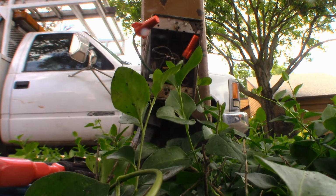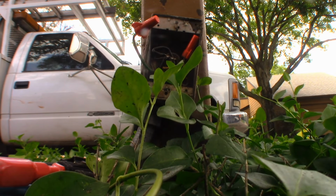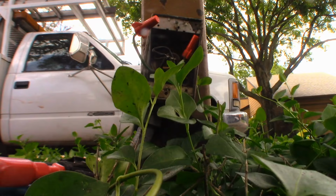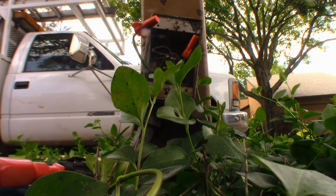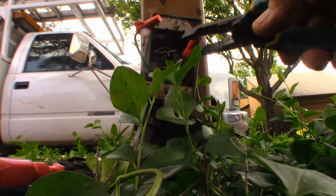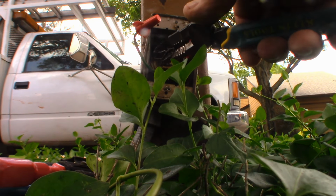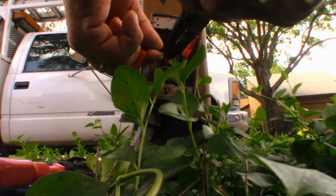But it may be the fixture itself. It's not the fixture. I was out here a few days ago and checked it. It has a short somewhere underground between here and there. It's not the bulb? No, it's not getting any power. It's not even getting any power down here. It's getting about 40 volts, which is not enough. So it's got a short somewhere.